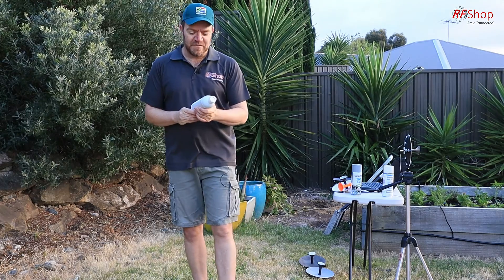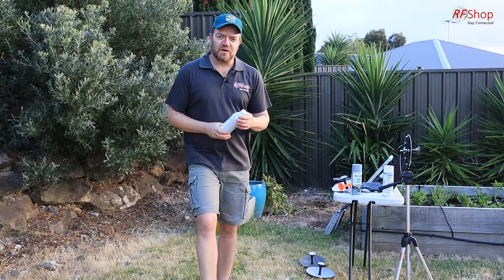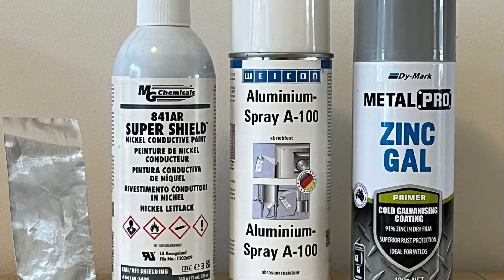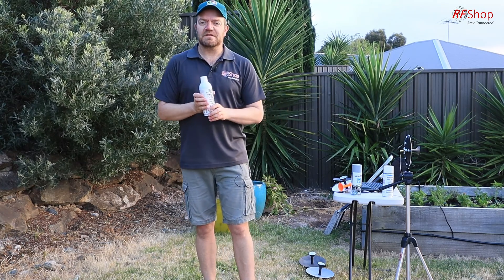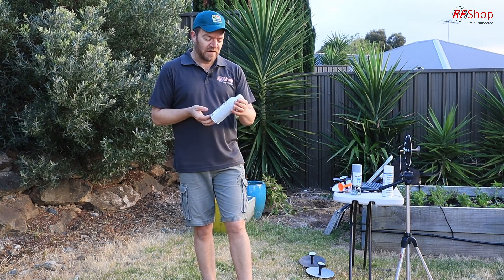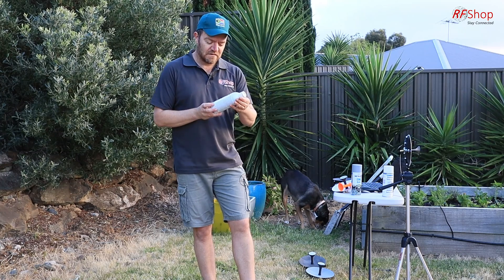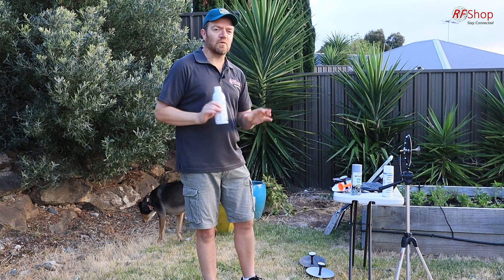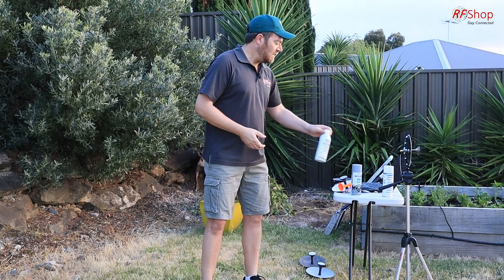The last one is the bee's knees. I got this from recommendations from fellow antenna engineers in the industry. I've also done some reading online and in a proper industry sense, this is really a good one — it's nickel spray. Now this was quite expensive: 140 Australian dollars to get it here. But the can is still pretty full after one dish, so if you consider how many dishes or antennas you could spray, it's probably not expensive either, though it is four times more expensive than the aluminium spray. I'm told this should work really well from a performance perspective.